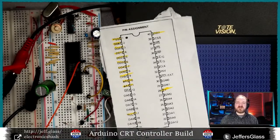There's a PAL system over there, which was introduced later in the life cycle of television and therefore is a little bit more smartly constructed than the way that we do things here in the States, because we kind of kludged color in after the fact. But that's what, so the Y, phi A, and phi B: Y is the luminance, and in fact that's all we're looking at here. Phi A and phi B are some of the color components. We would need additional circuitry to combine those in.